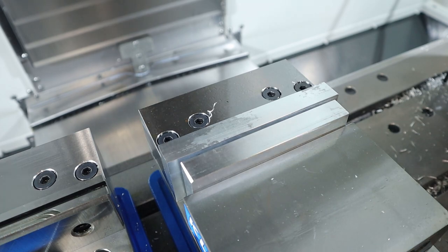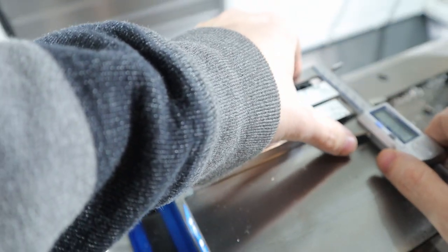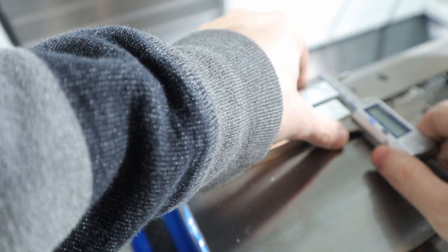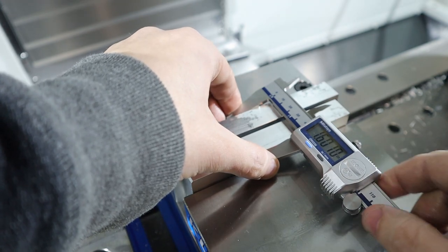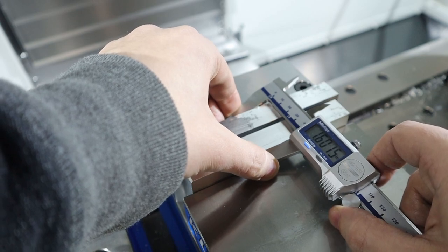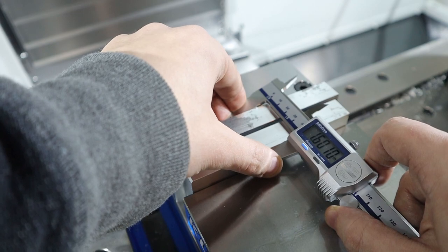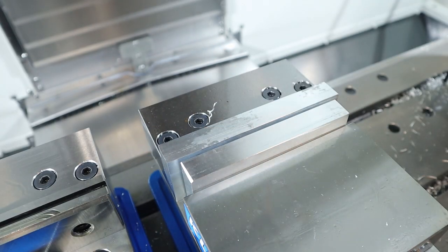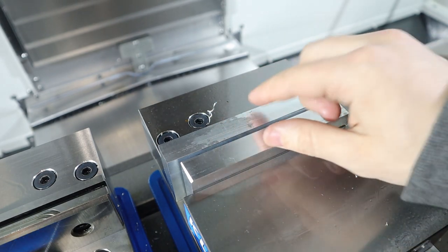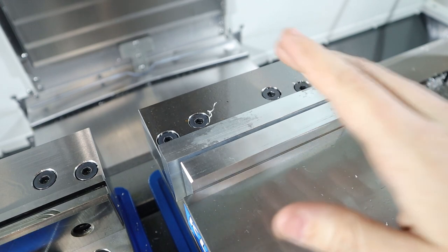I used a gauge block to separate them, but in the future, I'd much rather use like a 1-2-3 block or something. But I needed the small distance. Pretty close. I don't know if you guys can see. It's 160, and the lowest I can get is 1.601. So within 1 or 2, which is pretty good for soft jaws set up like that, because the soft jaws could be milled a little oversized. Sweet! So I'm going to zero this in, and we'll start.